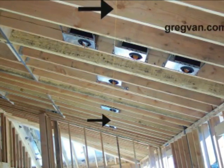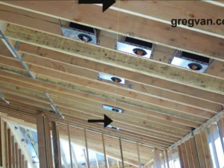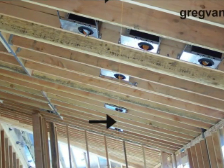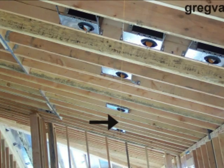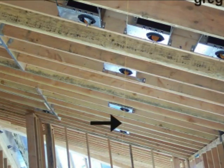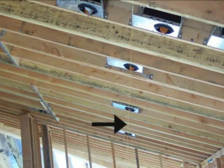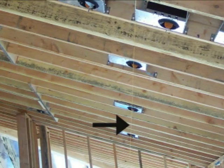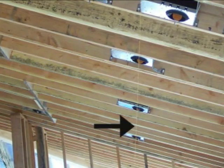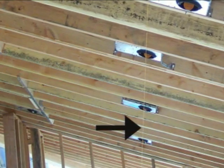Another thing you can do — and I haven't seen a lot of electricians do it — is they run the string down the center of the light and have to adjust the light, which could be off a little bit. But if you want to get a little trickier, run the string down the side of the box, either the lower or the upper flange. This way you can get it perfect — all of them will line up perfect. When it's in the center, sometimes you're going to have to get your measuring tape out, and it's going to be a little trickier.